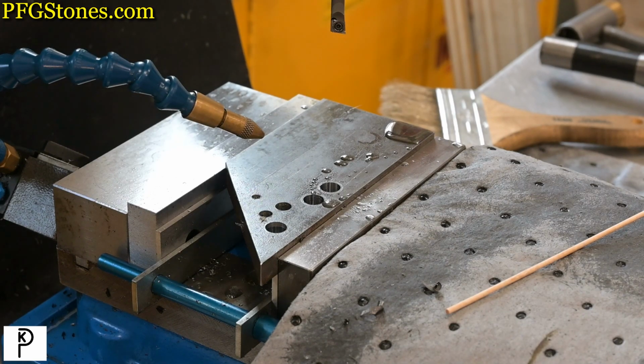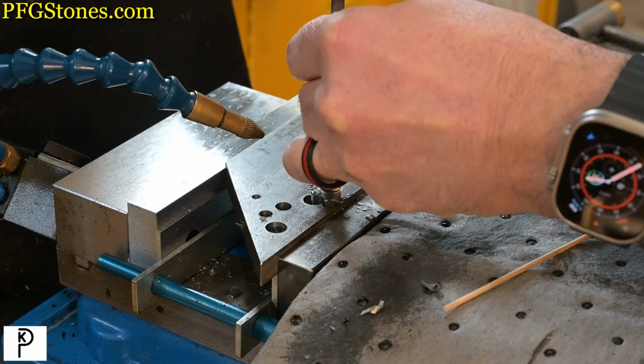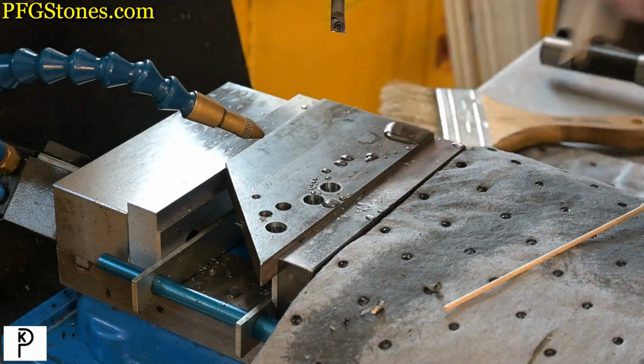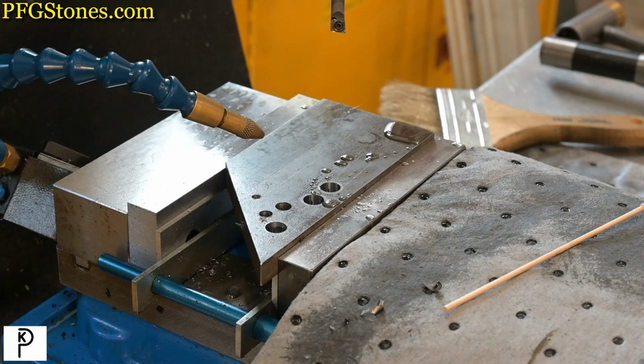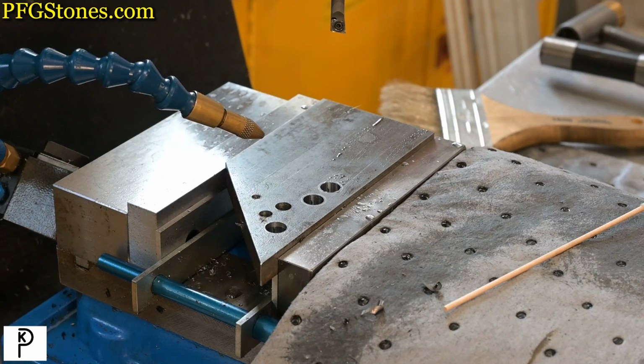I think one of the things I need to do is go to a drill size that leaves less meat with a boring tool to do its job. So with the calipers, that cut was unmeasurable. It's pretty encouraging. So we're probably going to set up here, move over, do another hole. I think I'm going to get a drill bit that's closer to final dimensions, which is 394.